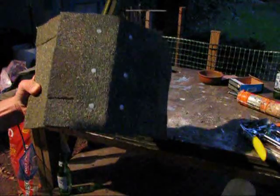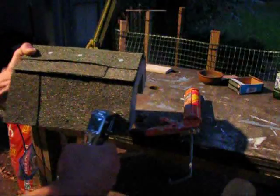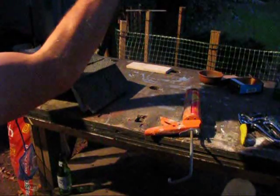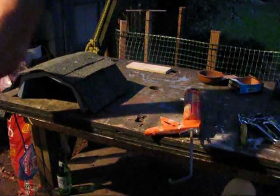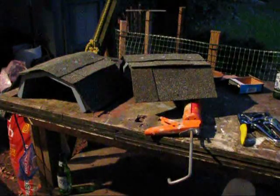So, what I got is roofs roughly attached. I'm gonna put a little bit of roof flashing cement on the top nails, and on the sides where it's sticking out, I'm gonna put some flashing cement here and just use regular half-inch staples to hold it in, so it doesn't show so much as the big things. Roofing nails aren't going to be noticed from the top because it'll be way up there. So I'll let that dry overnight because it's nighttime, and I'll put it up tomorrow.